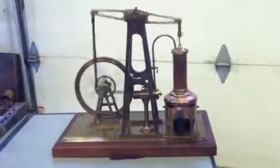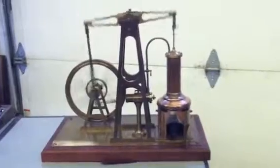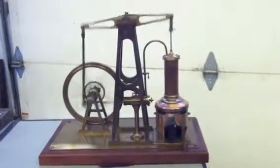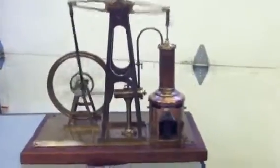It's running pretty good right now. It's really picky — put a little bit of cylinder oil on the horizontal cylinder, but don't put any oil on the up and down cylinder or you'll really be screwing it up. It's going good right now.